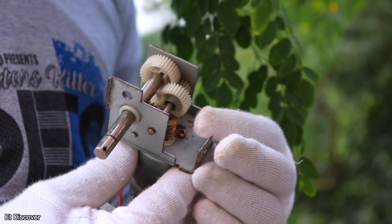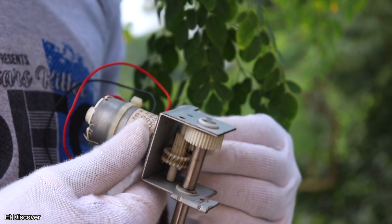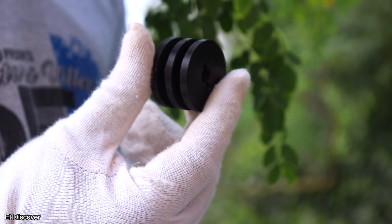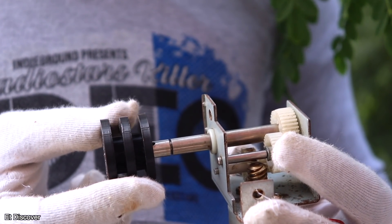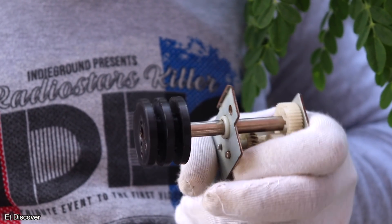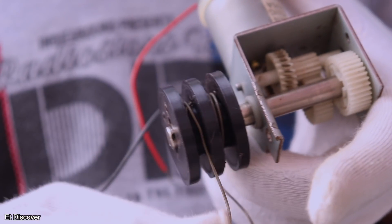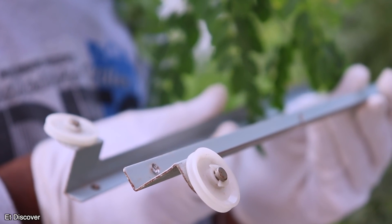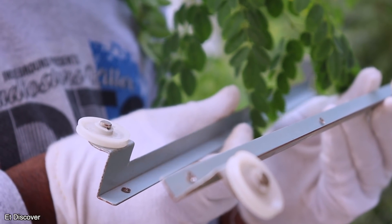This is the powerful motor which I used in the previous video, which is really capable of moving this large solar panel back and forth. For this motor I have put a pulley made by a 3D printer so that I can fit a nylon rope in it. Remember, you must twist this rope clockwise and anticlockwise so that it works properly. I also used two pulleys to keep the rope at the right angle, which I got from an old xerox machine.